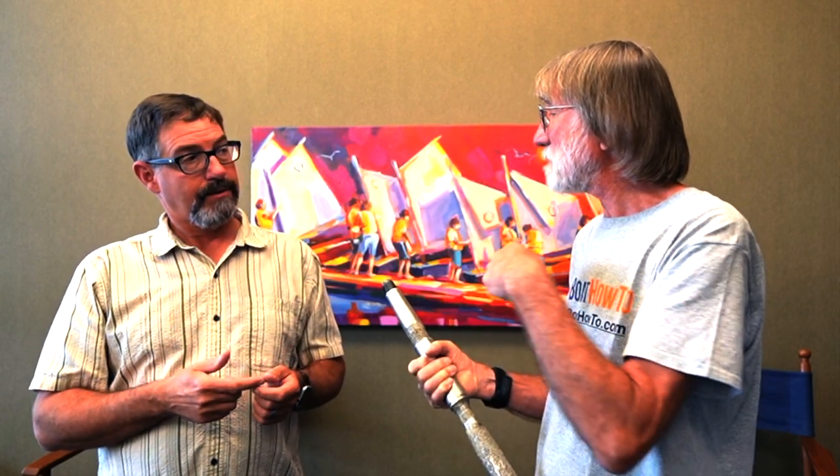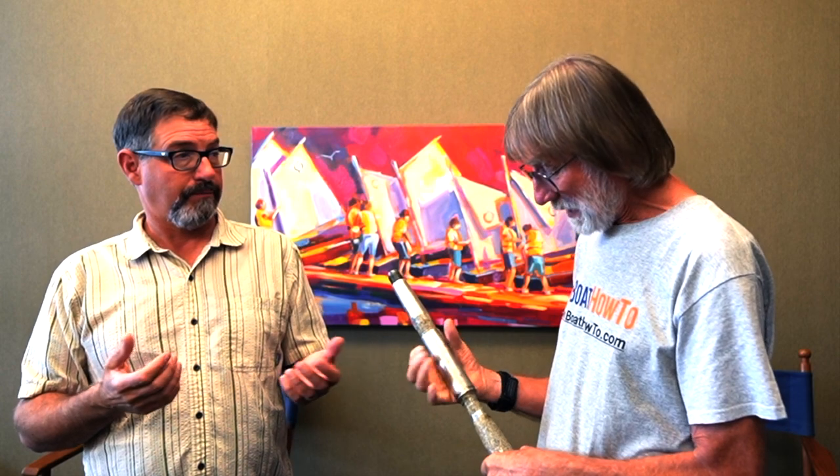I think I may know what happened. All of the battery negatives should be tied together to the common ground point on the boat — according to ABYC, which is what we both teach and recommend. If the cranking battery was not tied to the common ground point, but the strut was through the bonding conductors, then we've got a path: from the alternator to the engine block, down the shaft, into the water, up the strut, and back to the house battery — because the alternator's tied to the house battery. There's no connection between the house negative and the cranking negative. That would have solved the entire problem.